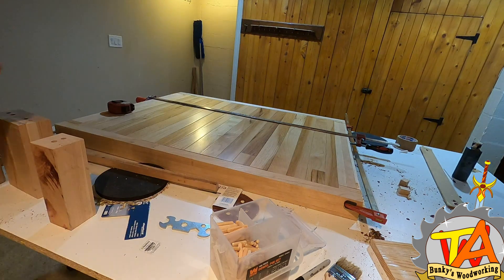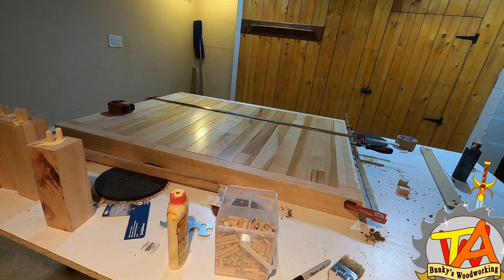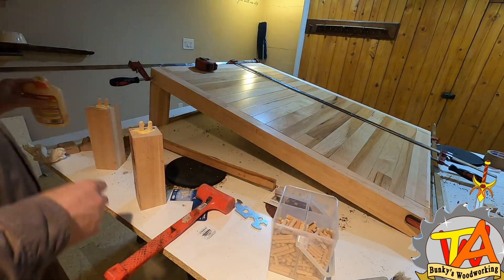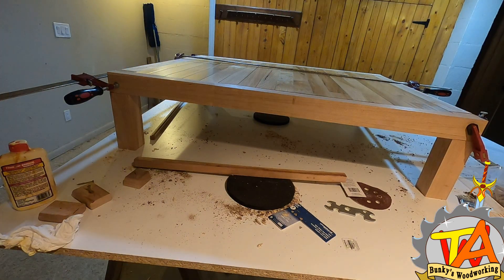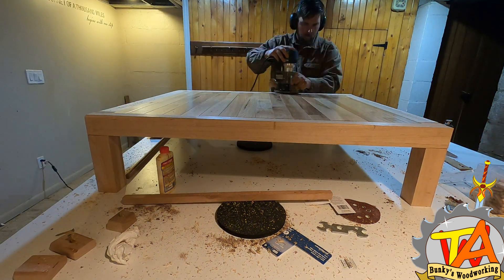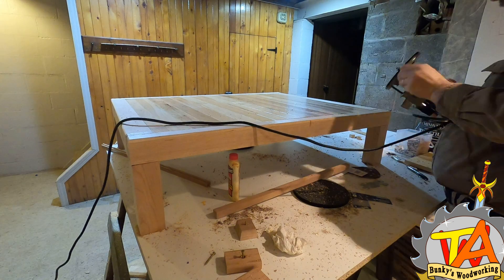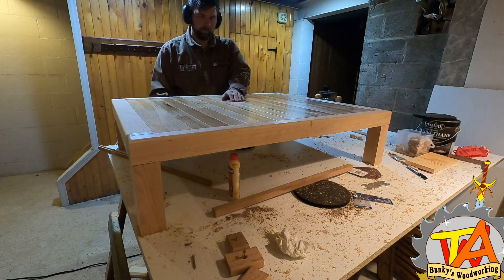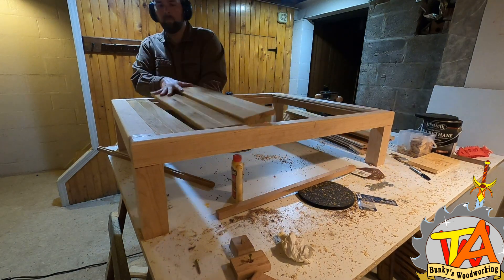At this point, I glued the legs onto the frame. The dowel rod jig had really paid for itself over the last two projects. Now, using a round-over bit in conjunction with the router, I was able to go over all of the corners on the stage. I had to remove the flooring off the stage in order to access the sides so I could round over the edges.